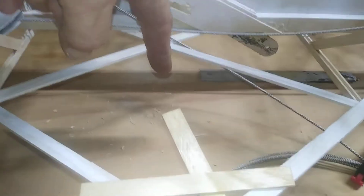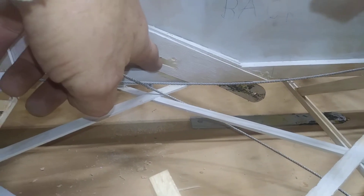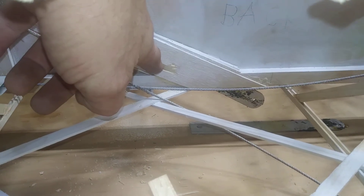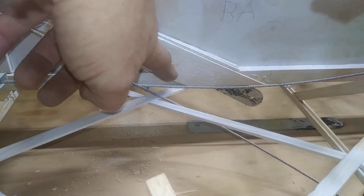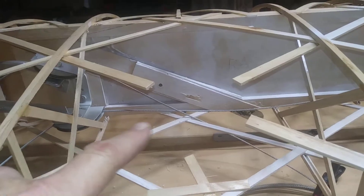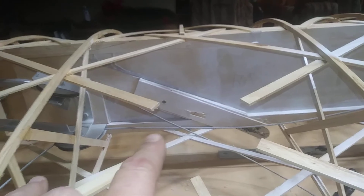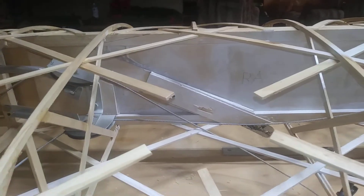I've got it laying right down there at the bottom, and I'm going to glue it right back in after I drill the hole out and get the bolt in there. I'll lay it in there, glue it in — it'll be stronger than original. Then I'll just splice, or scab splice, my geodetic back together right there.